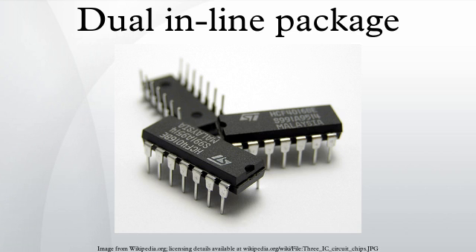Common packages have as few as four and as many as 64 leads. Many analog and digital integrated circuit types are available in DIP packages, as are arrays of transistors, switches, light-emitting diodes, and resistors. DIP plugs for ribbon cables can be used with standard IC sockets.